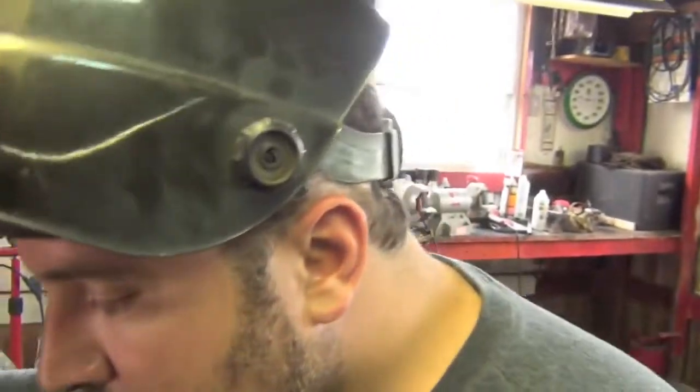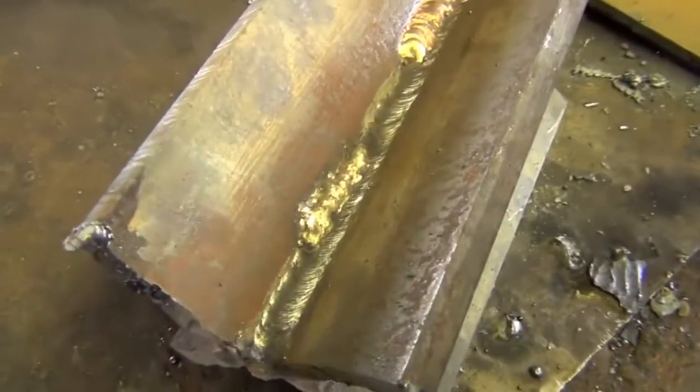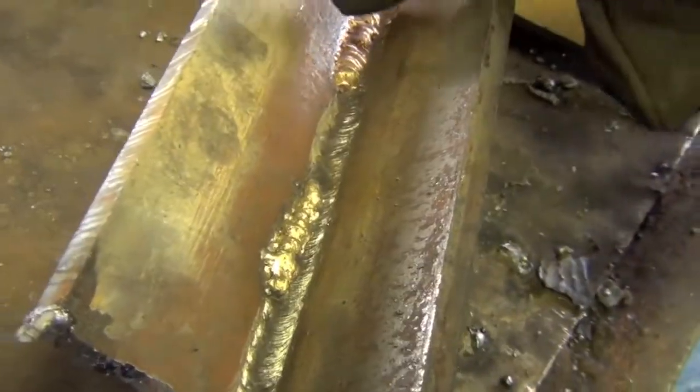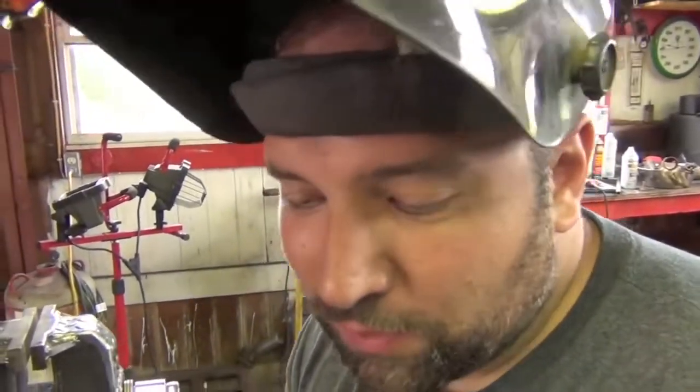On this one you will not win a beauty contest — the aluminum makes a different appearance. The looks vary with how much you preheat your casting. This was a pretty cold piece of metal and we didn't preheat anything, so it didn't flow quite as nicely as pictured. But on a casting, if it sticks together you're in business — looks are kind of secondary. Getting the casting done is the top priority.